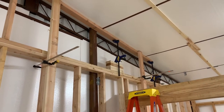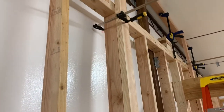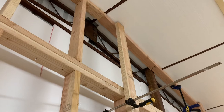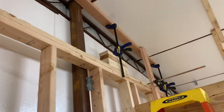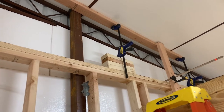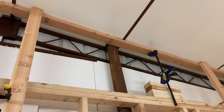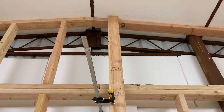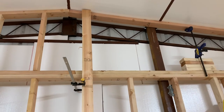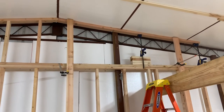I thought I'd show my convoluted process for doing this. What I do is take a 2x4 and clamp it to the wall that's already there and bring it up so I've got an idea of where it's supposed to be up on the ceiling. Then I clamp it by turning those grip clamps — I've got them inverse so that they push instead of clamping — and I just clamp it up to the purlin up there. Then I run a self-tapper up into the purlin holding it in place, then I take the 2x4s back down and individually measure each of the 2x's that will go up there. It's got about a 7-degree rake, 7-degree slope.